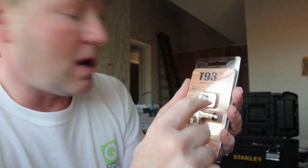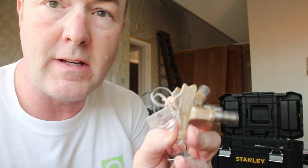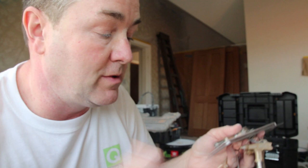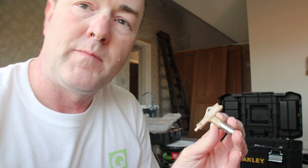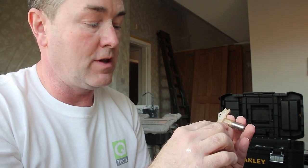You can go to a 208, which is slightly bigger than the 206 — common sense. To remember orifice size, think of dilation: small numbers, nothing comes out; bigger numbers, more comes out. So the lower the number, the smaller the hole.